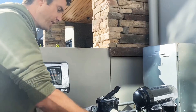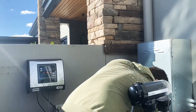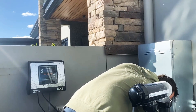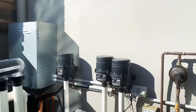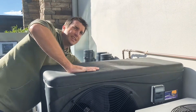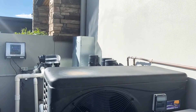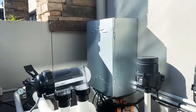So what we're going to do now, now that it's kind of primed up, is turn it off. I'm going to put it here to recirculate. Recirculate is going to bypass the filter media bed. We're going to ramp this up again, turn this back on, and see if we're getting enough flow. If all of a sudden we're getting enough flow — we should be getting heaps of flow. Look at that flow cell.